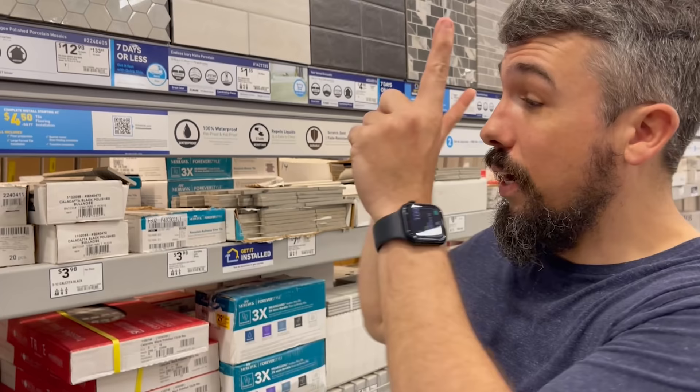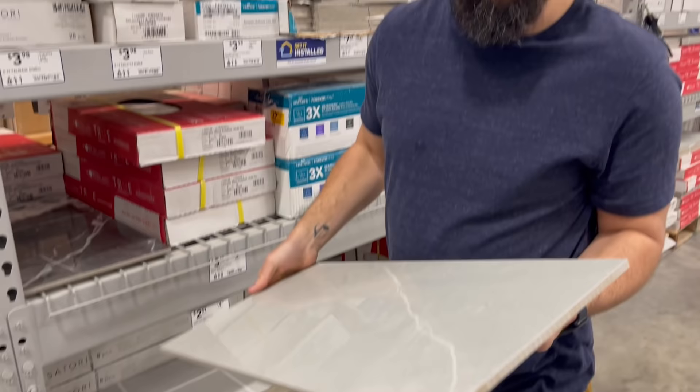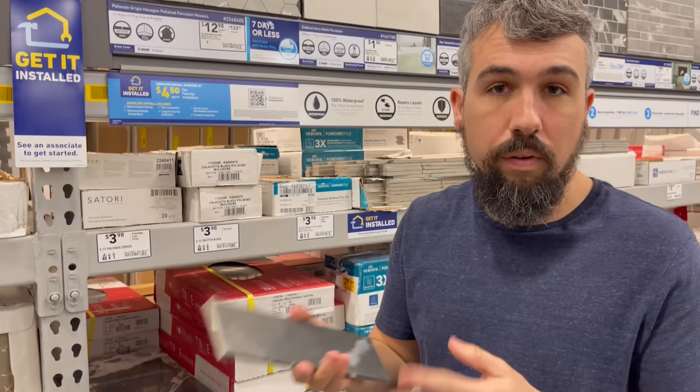Something I've been using for years that is super useful when you need a perfectly flat surface for sanding is actual tiles. Look for pieces that are glossy-smooth on the front and absolutely perfectly flat. You can use spray adhesive to put sandpaper on them and use them for sanding nuts, saddles, and things like that. The cool thing is that because they're stone, they don't change and ebb and flow with temperature and humidity changes. Super cheap, super useful, and you can use them all over the shop.